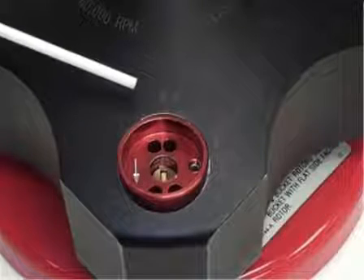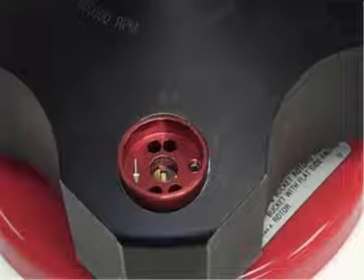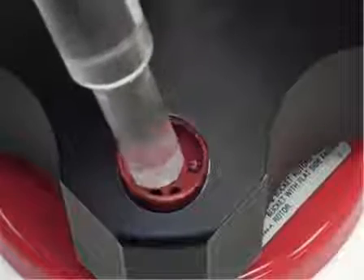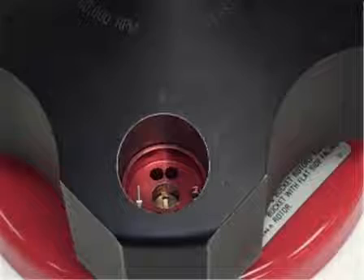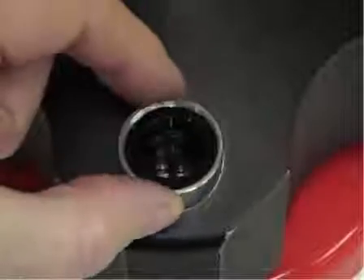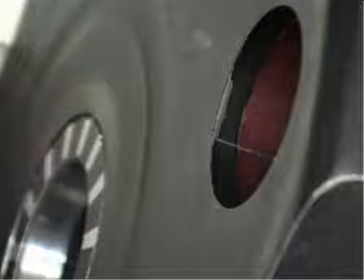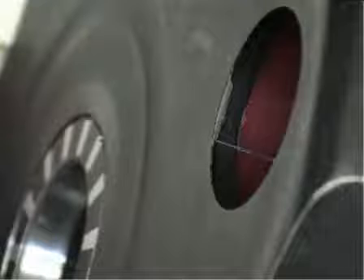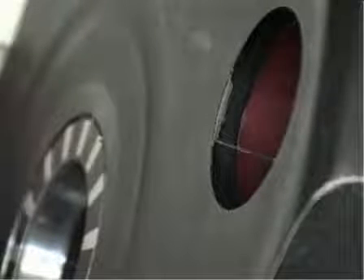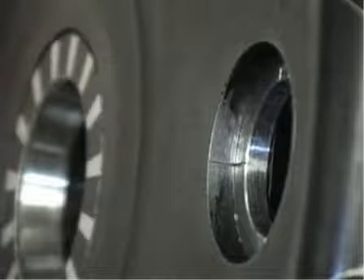Using a 4-hole rotor, place the counterbalance into position 4 so that the white arrow is visible and pointing in the direction of centrifugal force. Using an alignment tool, make sure it is all the way down inside the rotor. Position the sample cell with the housing plugs facing the center of the rotor and the word OUT on the screw ring visible. Again, using an alignment tool, make sure it is all the way down inside the rotor. Looking from underneath the rotor, align the inside scribe mark — the mark closest to the center of the rotor — with the scribe mark on the counterbalance using an alignment tool. In the same way, align the sample cell at position 2. After all the cells are aligned, the rotor is ready for placement in the centrifuge chamber.